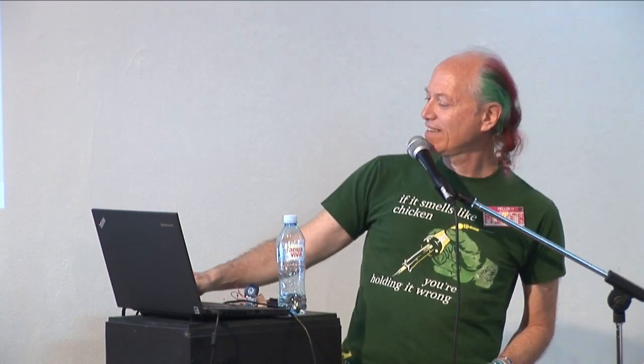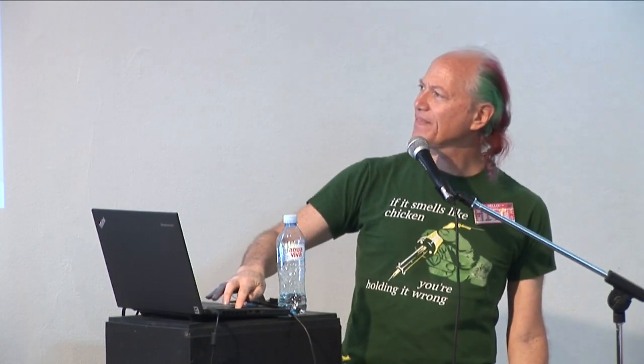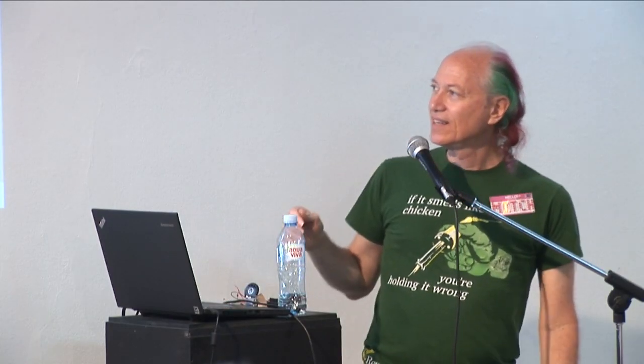I can just come down here and get rid of LED and make that 2. And now pin 2 would be the output pin instead of 13. But let's keep that as 13. But let's say also I want to hack this, and instead of making pin 13 an output pin, I want to make it an input pin. What would I do? Any ideas?